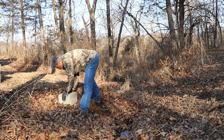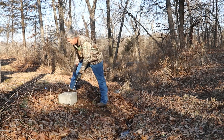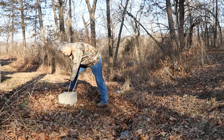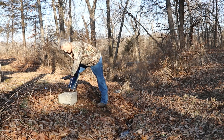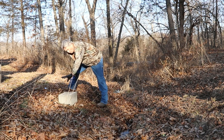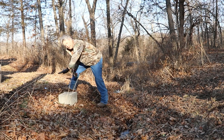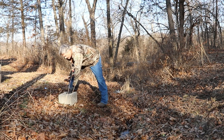Now these concrete blocks will settle a little bit over time and that's fine. By the time we've gotten our 9 or 10-inch timber across here and our 4 to 6-inch rails across the bridge, we're going to be getting up into this range, so I don't want to have to add a bunch of dirt up here either.